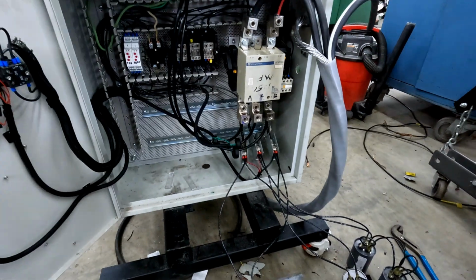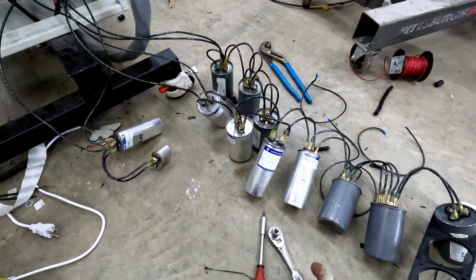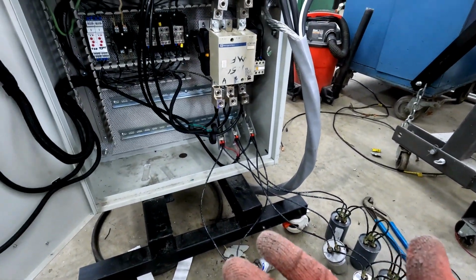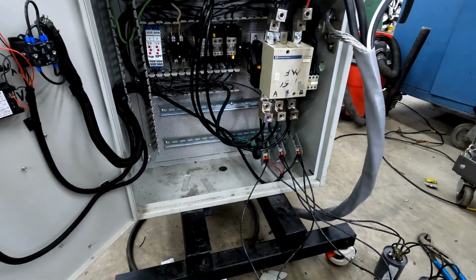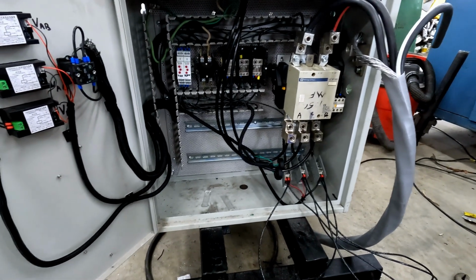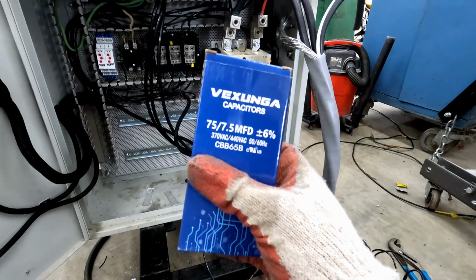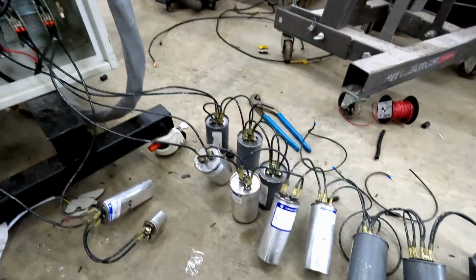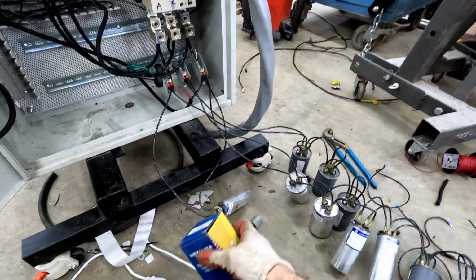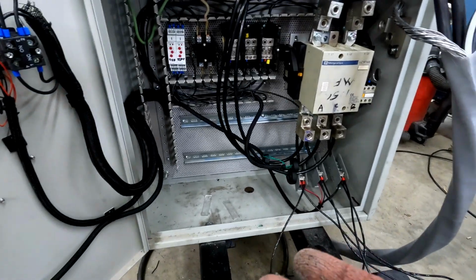After balancing the system for a little while, I ran out of capacitors, but I got very close with my values. I was seeing 260 volts on the two generated legs and 240 volts on the incoming leg, which should be right where I want to be. I went ahead and ordered some larger capacitors to replace the bank of capacitors I had built up. The new capacitors should be more reliable, and also I want this all to fit inside of my panel with ease.